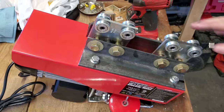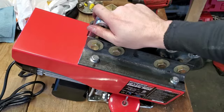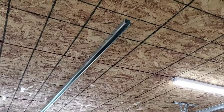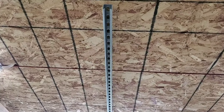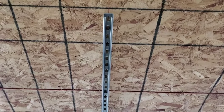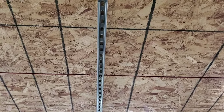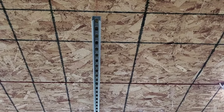Everything's all put back together, ready to go. It seems to be rolling as it should — solid, not going anywhere — so we're going to go ahead and put it up in the track. Here's where the hoist and trolley is going to go up in this track. You can see it's bolted right to the rafters. I used structural screws to run it right into the rafters, so everything should be nice and strong. I've got rafters every two feet, so there's support every two feet along the way. Let's get the hoist up there and see how it works.